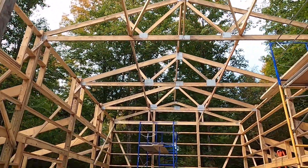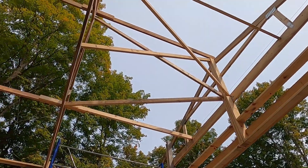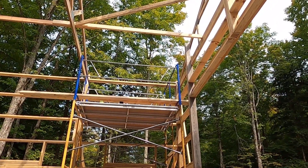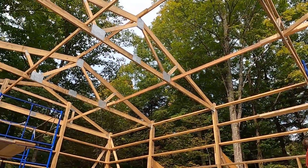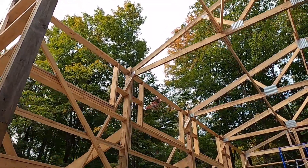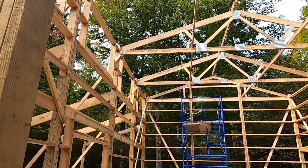We've been working on truss bracing and it is so much more complicated than I ever thought it would be. Squaring up a building is hard. Yesterday we spent hours just trying to plumb the first and second truss, and the problem came down to the second truss having a bend at the joint in the middle. So we yanked everything around, got everything into rectangular form, and finally got that cross brace in place, which plumbs the first and second truss. In theory that should plumb the rest of the trusses since we have these three braces going down the path. We then put in the first set of diagonals — they fit like a glove. Where we started today was squaring up this wall with another set of diagonal braces going from that junction to the corner here, and in theory that should lock everything in place and square everything up.